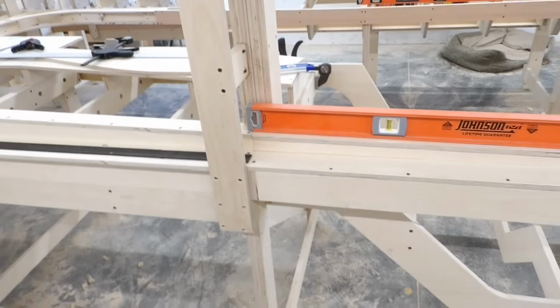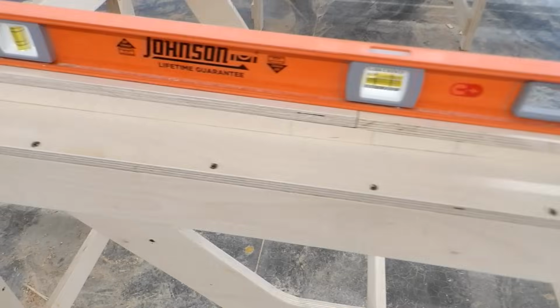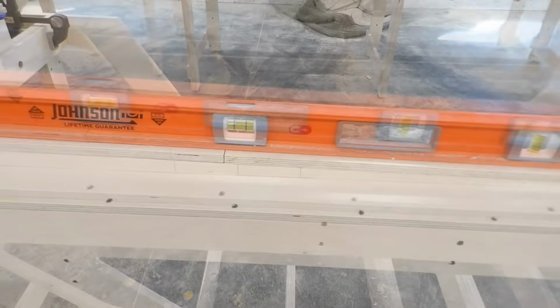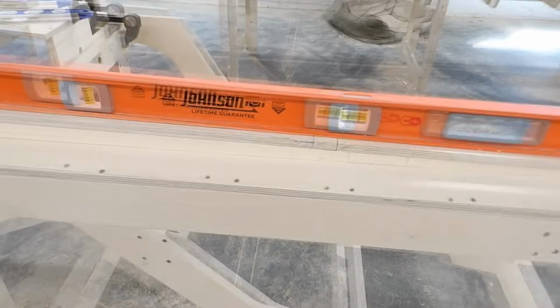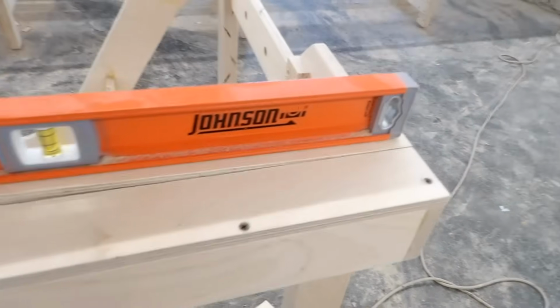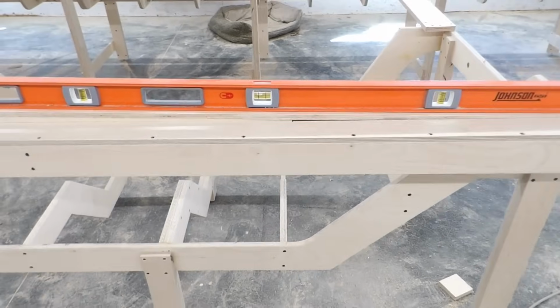Well, I've now made all the pieces for the rest of the falling grade. There's a 2 inch wide strip of 1/2 inch plywood and a long tapered piece. It needed to be 1 3/16 to nothing over 55 inches. I elected to do it in 2 halves, using a parallel piece that's wider than it needs to be. That way, once I've got the first wedge cut, I can trim the other half on the table saw quite easily. And where the plywood drops down to the same level as the other one, I had to cut a piece out. It's about a 2 foot long cutout. Next thing I've got to do is just permanently attach it. So let me get on with that and I'll be right back.